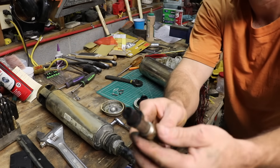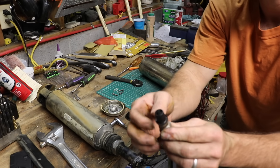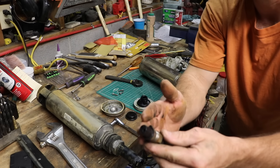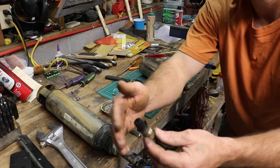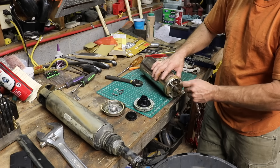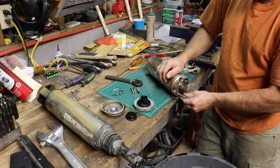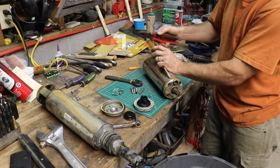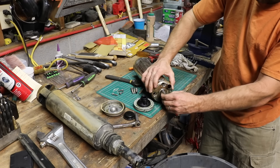There's a little plug here and it threads on. There's a seal so that you can make your electrical connections from in the water to inside the pump without any issues with water penetration. Might have been our failure point right there — that seal is cracked.